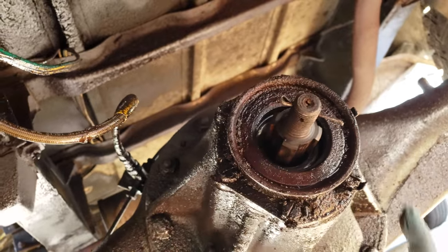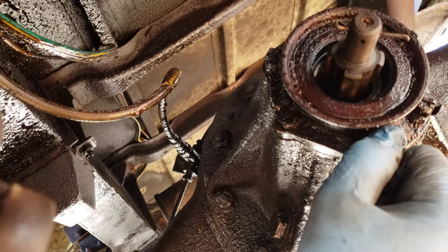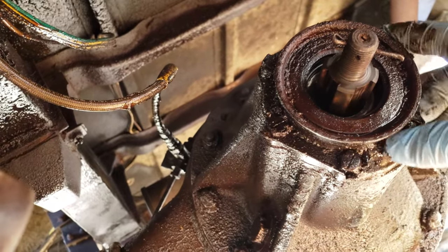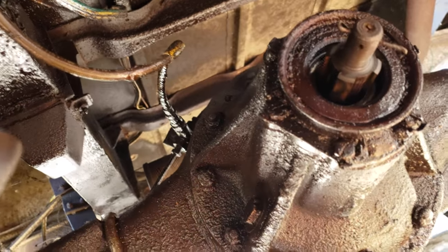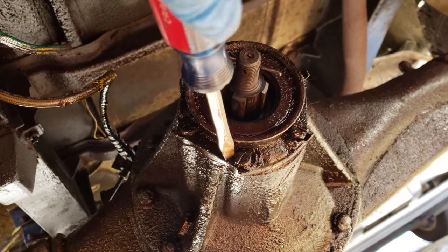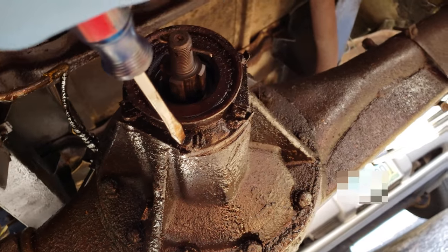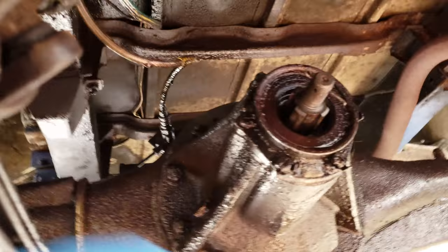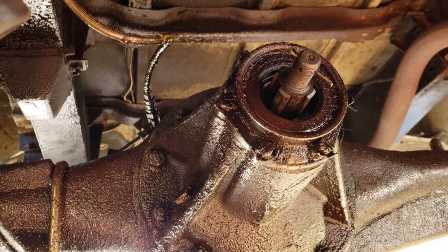So for this flange here — that is the seal retaining housing — it's got six hex head slotted screws with keeper plates that go in between them, with tabs that bend over and lock onto the flats. I can't figure out what size they are and can't really get a socket in, so what I do is take a screwdriver after I've bent the tabs down. A trick with these screwdrivers: you notice how it has a square cross section? That's what you clamp on with a wrench. It works a charm for getting those stuck screws out.